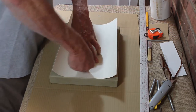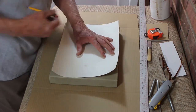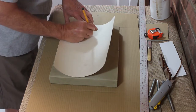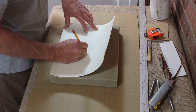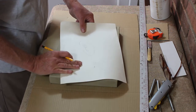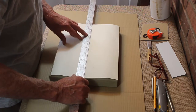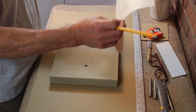Find where the holes are and put your finger or thumb in to make an indentation — you'll make a nice ring. Get a sharp pencil and put a mark through the middle of it. Make sure you're still lined up, find the second hole, put the sharp pencil in the middle of that ring, and make a little hole. You can write 'to the wall' on that side, and if you want, turn it over and write 'face' on the other. Before going further, use a rule to draw a horizontal line across the two pin holes on the paper template — that'll help you line it up with the horizontal line you'll draw on the wall.